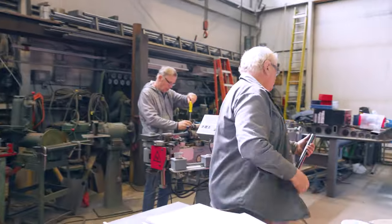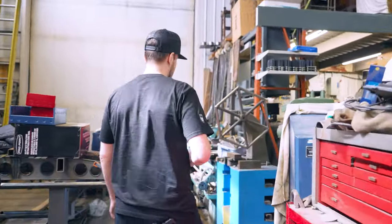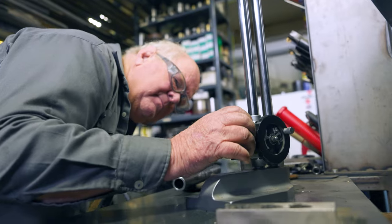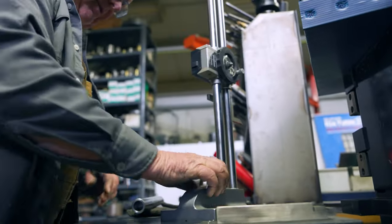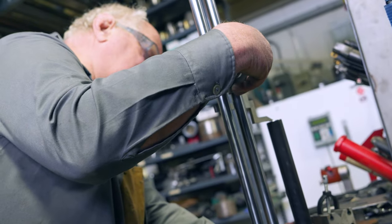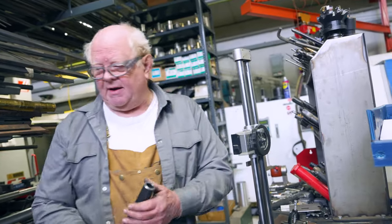While we were there the tube bender was actually being upgraded, so we hit pause on bending and moved on to the pivot tube of the swing arm. The first step is to measure it so we can see how much more we need to machine it to be perfect. It's at 11.141 and we want 11.125, so we need to take 16 thou off the end of that.